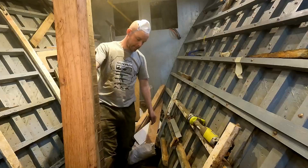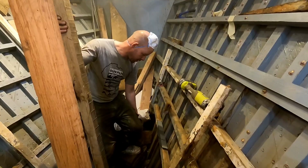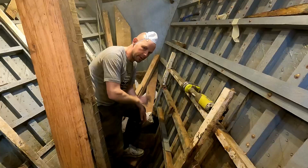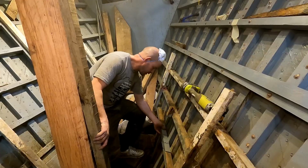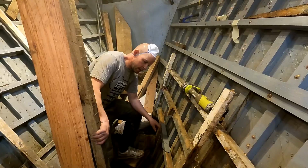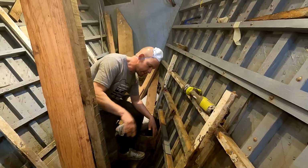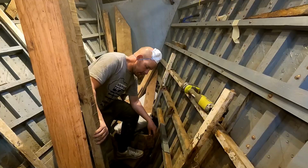How's the wood on the stringers looking? Yeah, it's really good. I said it was purely just there and there, so we're now going to put that in. But before we put that in, we're going to work out our sister stringer. Well, we're just going to go long. Keep it long. It's quite a high pressure part of the hull, I would have thought, here. And then once that's all in, I don't know about epoxy in it. I think we're going to use the marine sealant. So we're going to bolt it, and we're going to glue it. So it'll still have a bit of flex if it needs. What do you think, Gem? Yeah. So we've gone from never doing sisters to doing two in one day.